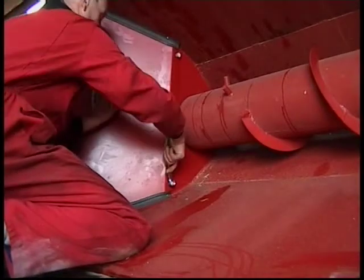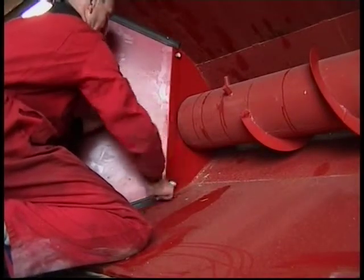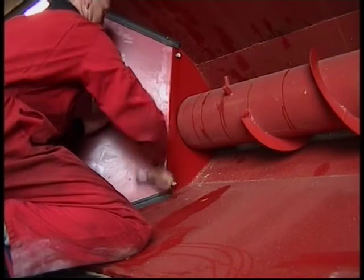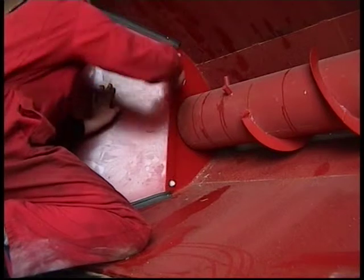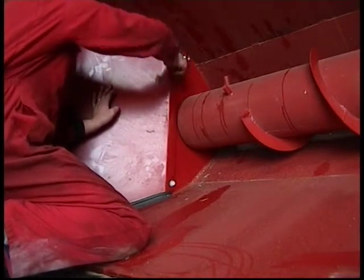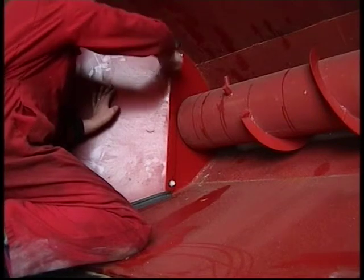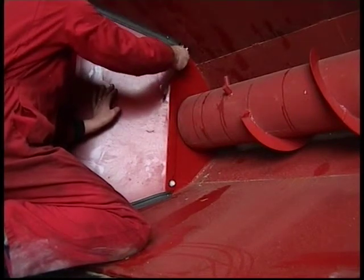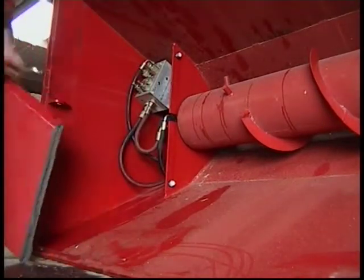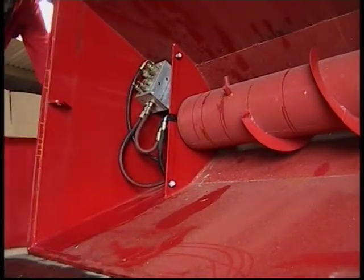The AG dispensers are fitted with the unique high-quality endless polyurethane belt, giving long and lasting durability. Regular routine maintenance will ensure your AG dispenser gives you the very best results with a minimum of problems. Prior to any maintenance, ensure the prime mover is switched off with the key removed. Firstly, remove the motor mounting guard inside the AG dispenser.